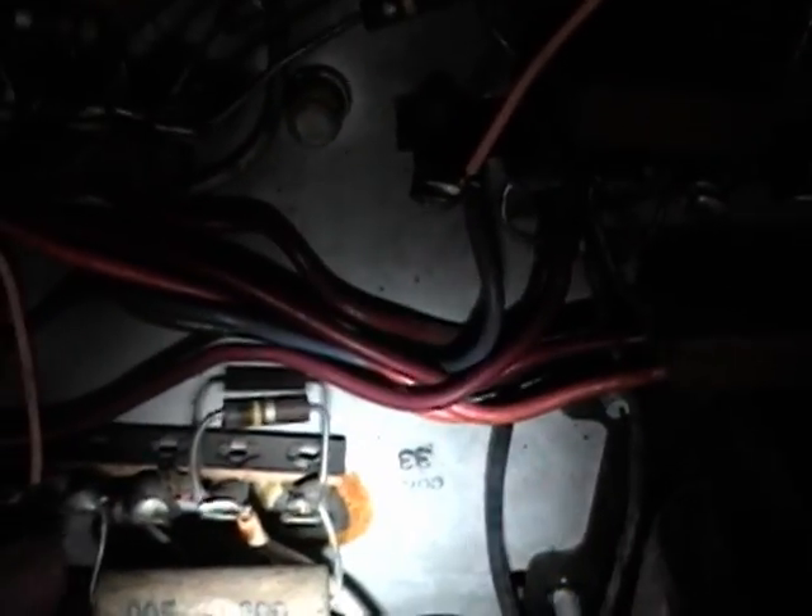Now to get these old parts out — they're mounted on terminal strips and the old leads were wrapped around and then soldered on. Two basic techniques I use: if it's in a crowded area with other parts attached that I'm not replacing, I'll just clip out the lead and leave a little tail — about a sixteenth of an inch of the old metal lead. Then I take the new part's lead and wrap it around like a nail to make a corkscrew or little pigtail, slide that over, and solder it on. It's a time-honored way to do this — I find repairs probably done 50 years ago that used the same method.